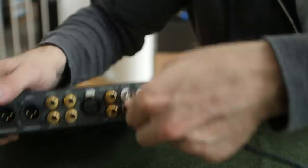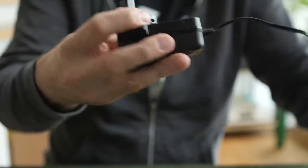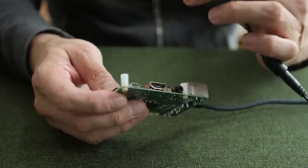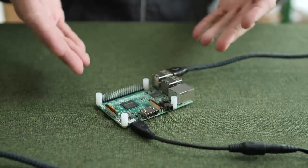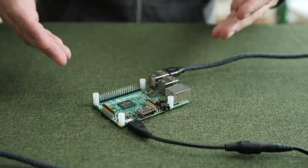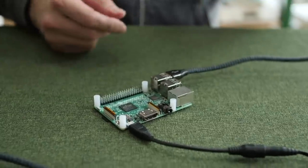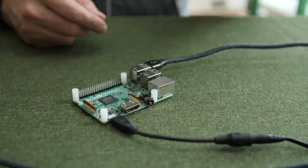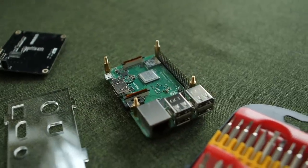This end goes into my DAC, the other end of the USB cable goes in here, and then we just use a 5-volt wall wart as a power supply — a switch-mode thing, nothing fancy. The micro USB socket on the Pi is where we inject power. So this is the most basic streamer at 35 euros. You can buy a case for it, and with power supply, case, and the Pi itself, you're up and running with a basic streamer for about 50 euros.